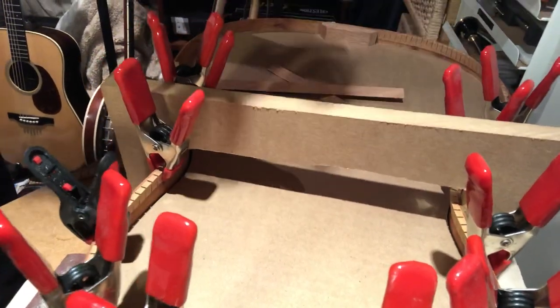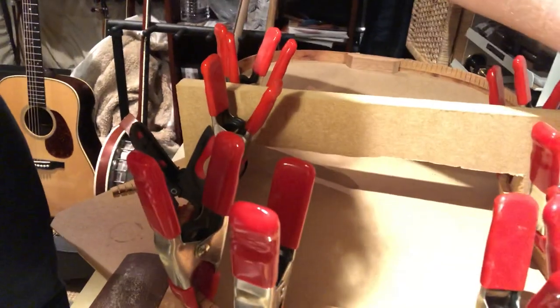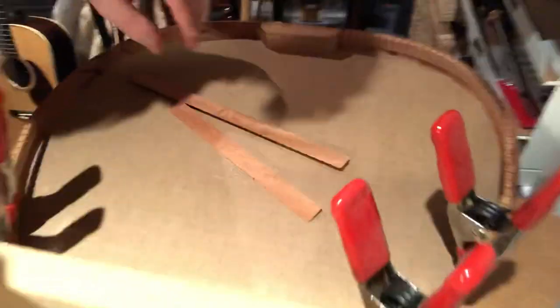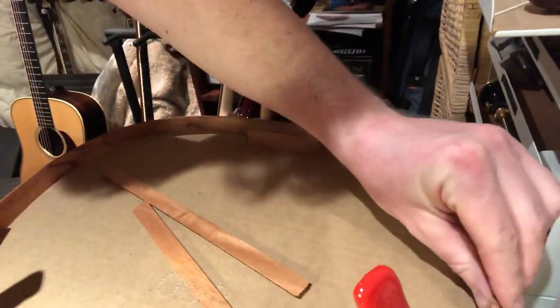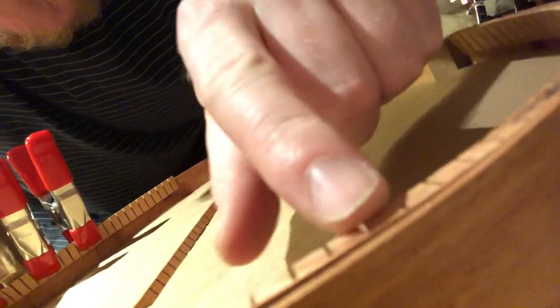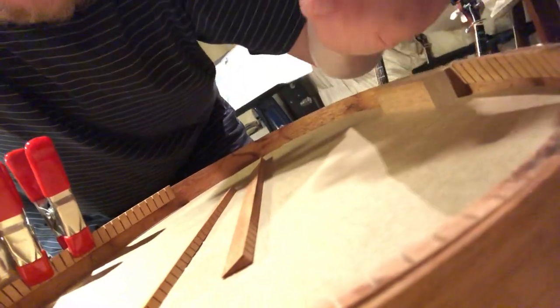This is kerfling, I think it's called. I'm about to glue these on — you can see them there. I've measured them and got them in position; this is just a dummy run, clamped in place to make sure I don't mess anything up. I'm going to take the clamps off, then glue these on. I'm meant to leave them sitting a tiny bit proud so I can file them down afterwards to be absolutely flush with the side of the guitar.